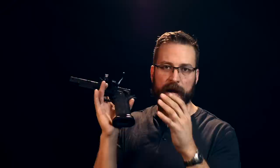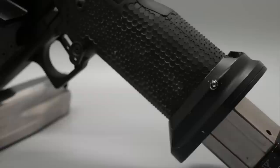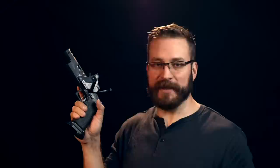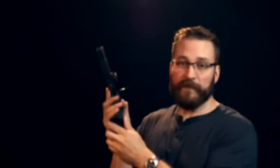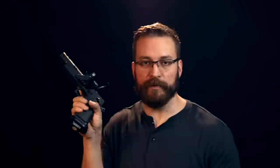Getting up onto the controls — all optimized for competition-style shooting. The safety has a shield on it, which is there to keep the knuckle of your thumb from touching the slide and impeding the slide from cycling. Because the spring weight used in the slide is very light — it's a hammer-fired gun — it's very easy to pull these out of battery. The slide lock is basically ornamental, because there is no over-travel stop. With even the short magazine in the gun, it doesn't make contact with the magwell. If the slide locked open, you could over-insert the magazine and damage the ejector. So the followers in the magazines do not engage the slide lock — the slide never gets locked open on empty.